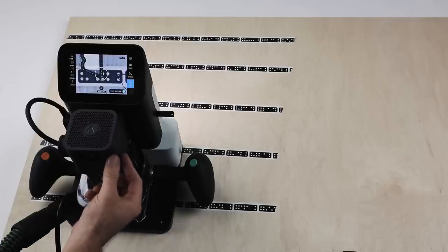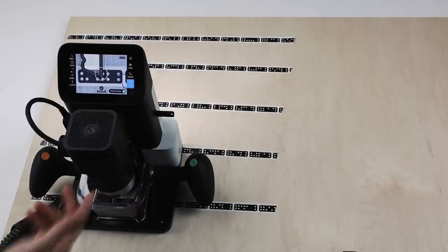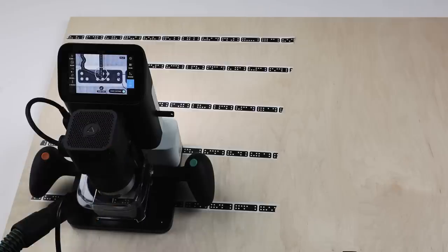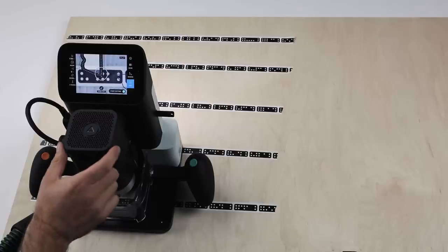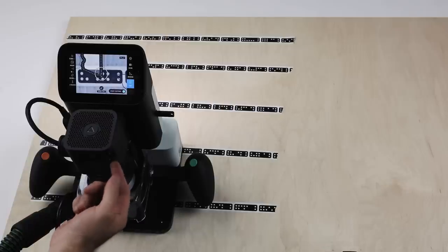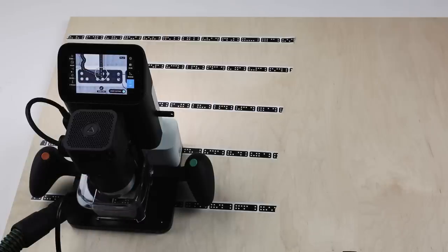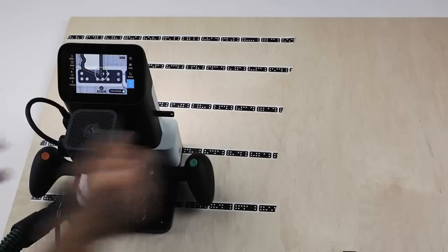One thing to check before we start cutting, we want to make sure we speed this up. So for engraving, we're running at around 3. For actually cutting, we're going to want it up around 5. So now it's going to be rotating quickly. You'll get familiar with how the cutting sounds and what a healthy amount of spindle speed and feed rate sounds like. But in the meantime, just set it to a high value. 5 is good, and we'll cut.